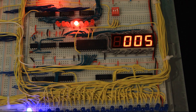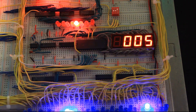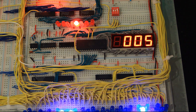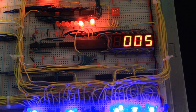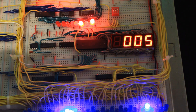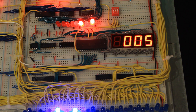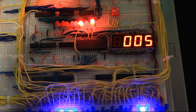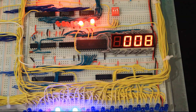Up a bit we have the output register — the 74LS273 along with an AND gate to control the clock, just like Ben Eater did. He thought it would save chips by not needing a bus transceiver, just using an 8-bit register. But it results in having to have this AND gate, and I've had to make this trigger on the negative clock edge instead of the positive clock edge because of glitching with the AND gate — likely a timing issue. I would not recommend doing this; instead you should probably just use 74LS173s so you don't have to have this AND gate and the related timing problems.